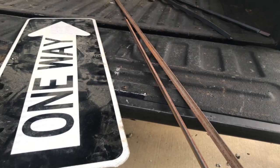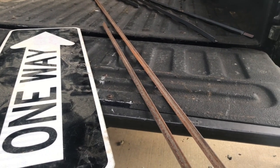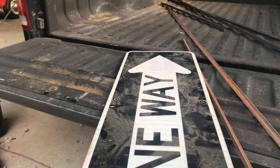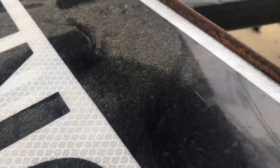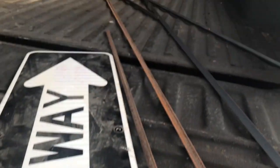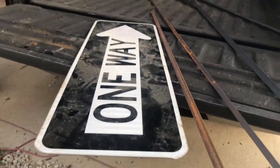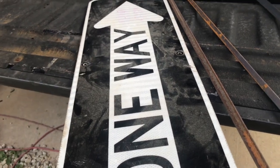My wonderful spouse went and picked up for me — because I work away from town — some steel. We're going to try and use it to build the rim. Basically I'm just going to build a track that this piece is going to lay in. There's not too much of a lip, just a little bit of a lip. This is half inch, and then we also have three quarter in case the half inch isn't strong enough — it's a little bit flexible. I think once I've cut it to size and made it a box it will be just fine. We'll put a couple of pieces kind of in the middle, probably two, as braces.